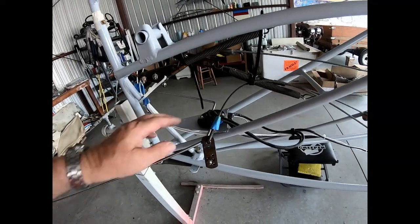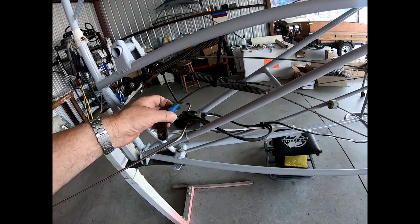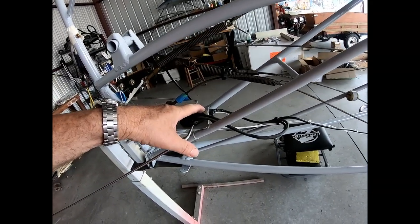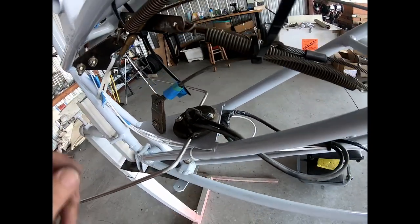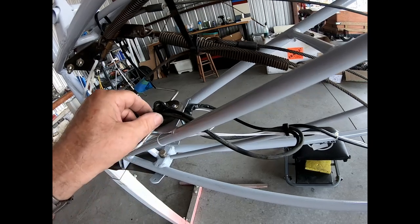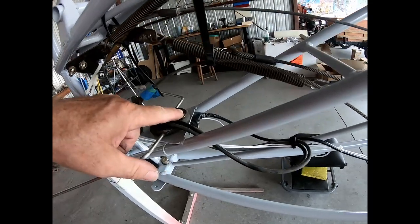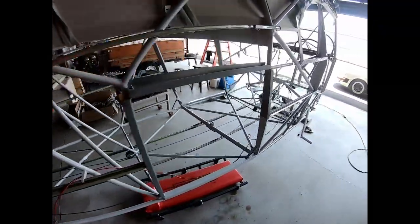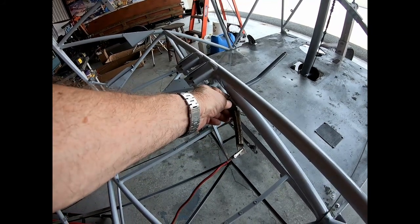I also put the VOR antenna back in, because at least the one side has to go through the fabric. Probably what I'm saying now is obvious, and everybody does it anyway, but one of these screws is also the ground for the VOR antenna and for my tail light, for the strobe. This is all freshly painted, so you clean off some area here to get ground contact. But before I put the cover on, I actually put the ground strap for the battery on. I also had to remove some paint here to make sure I have good contact.